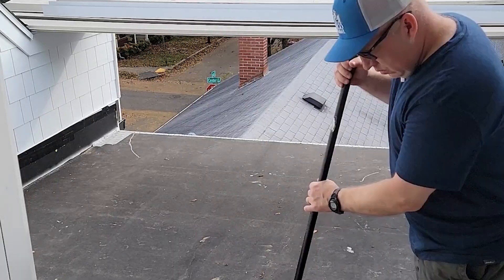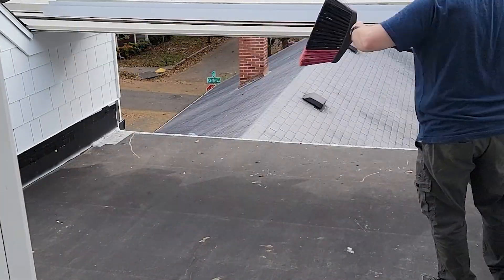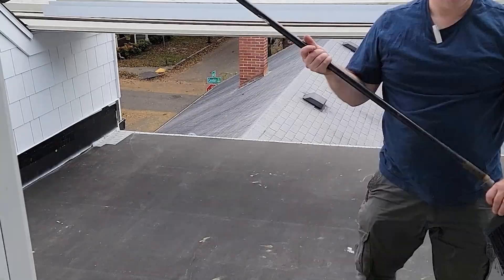I pre-staged this because we're on the third floor. One thing not in the instructions is the ice and water shield membrane we put down — our roofer installed that. They don't say you actually need it, but I don't like leaks. It's an extra membrane just in case water somehow gets around the flashing and sealant. We've had the ice and water shield down for about three months with no interior leaks. With the extra Wahoo layer on top, it should be even more impenetrable.